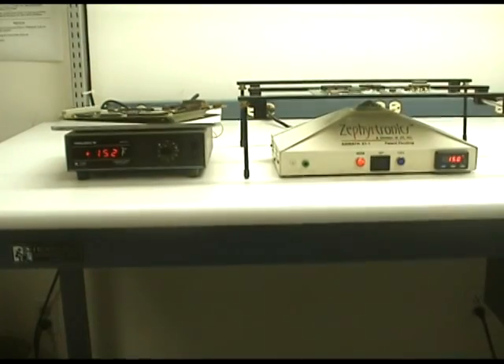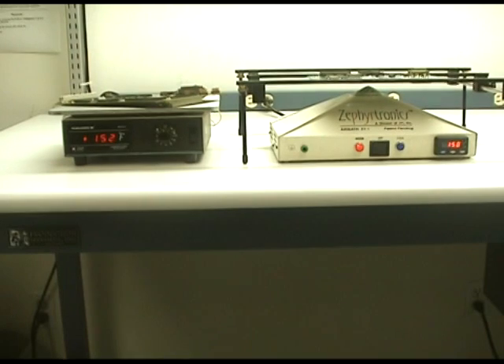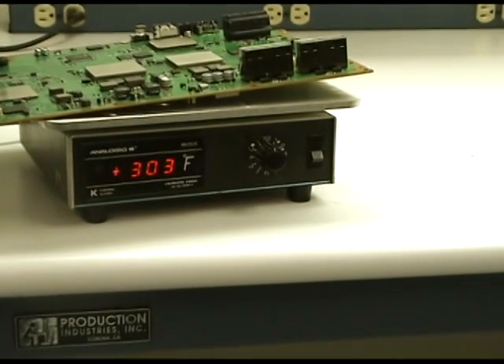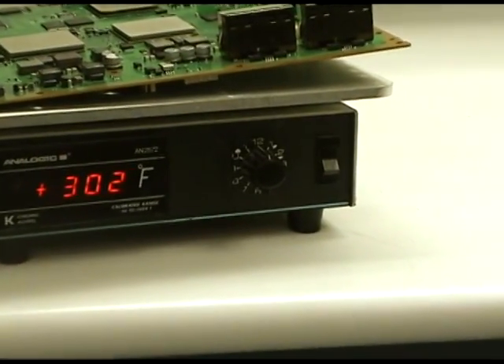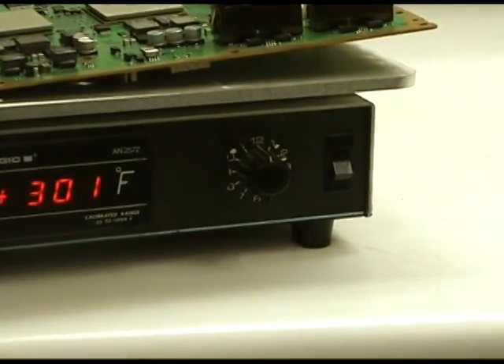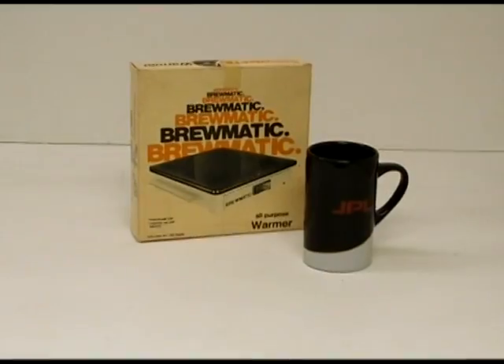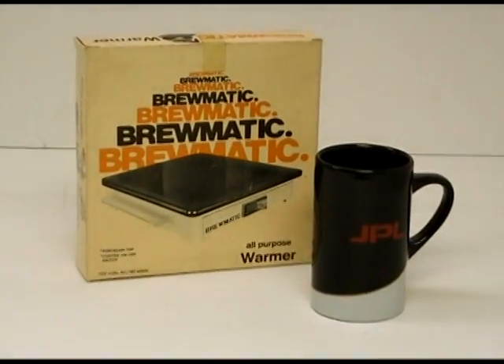A simple side-by-side comparison of a hot plate and the superior force convection air bath reveals the many inherent advantages that the air bath brings to the benchtop technician. This illustration shows that while the hot plate provides an indirect and extremely slow transference of heat to the PCB — what can take up to 12 minutes to preheat — can be done in as little as 3 minutes with a forced convection air bath. Still, hot plates do have their place in this world, just not with printed circuit boards.